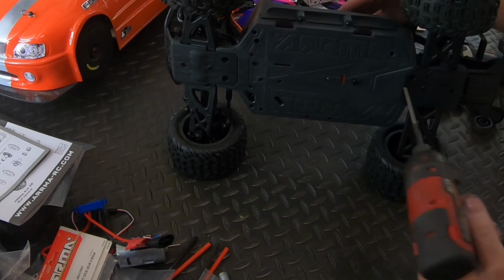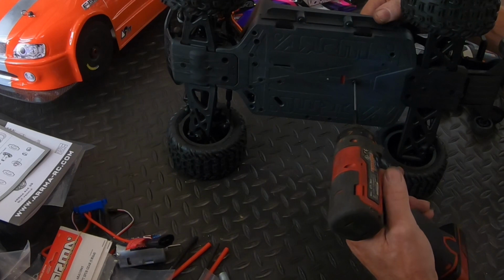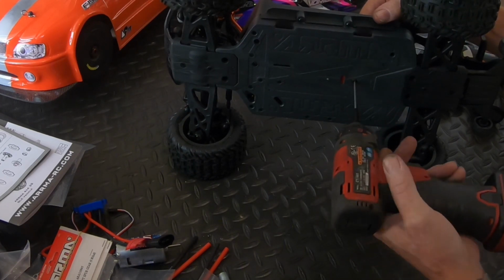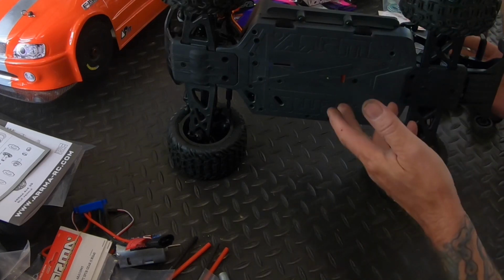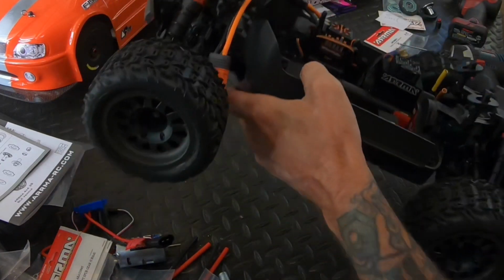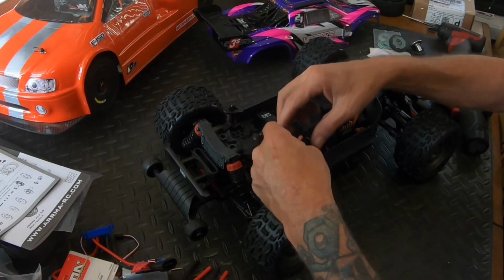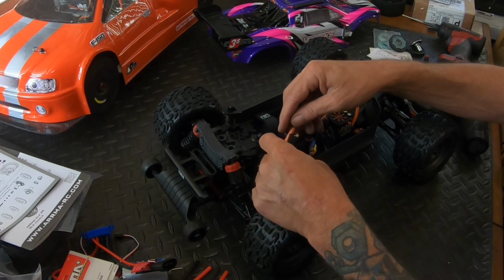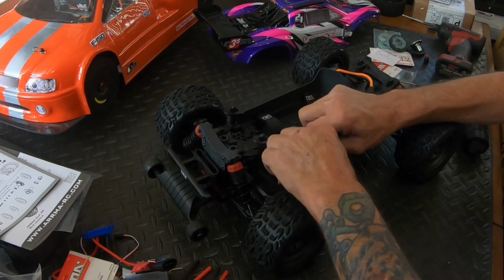I don't think a lot of these are going to be broken there, but I think these all have a mesh issue, which is going to cause an overheating issue. If that thing's binding in there and your mesh is tight, that motor's going to run extremely, extremely hot. Tony and maybe a couple other people, because I was listening to their videos, we all heard the noise. And you know, didn't think anything of it.